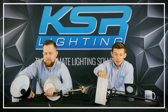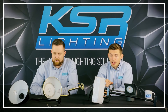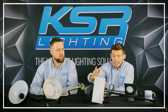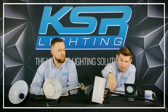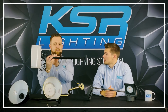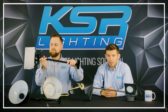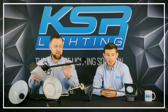This is the Nevelda CCT sign light, but the polycarbonate version. So if you've got projects down on the coast in high saline areas, this is a good choice of fitting. It comes with an arm so you can have it out from the building shining upwards at signs, or angled down. The head actually comes away from the arm so you can mount it directly on the wall. You can have a 520mm arm or a 220mm arm — three different mounting options really. And again, CCT, so you can select the colour when you get to site, which is nice.